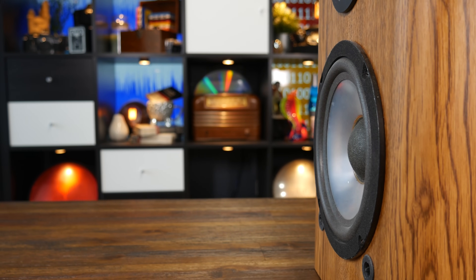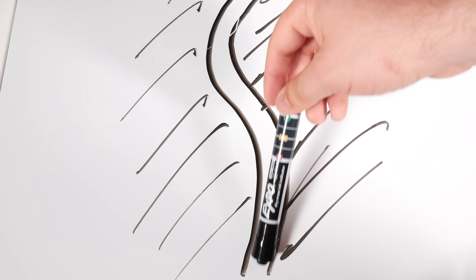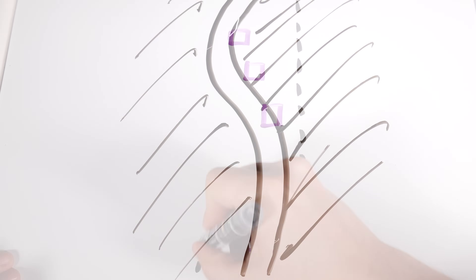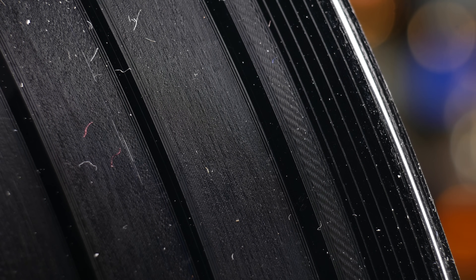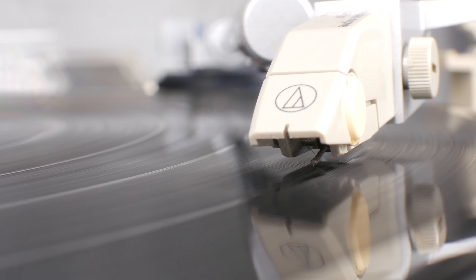Here's a crude analogy to explain the difference between analog and digital sound. A vinyl record's walls generate an analog signal by moving the stylus left and right. A record directly creates the analog signal via the motion of the stylus, but a digital sound source is instead sort of like a virtual stylus riding in a virtual groove. The sound samples are snapshots in time of where the stylus was. A DAC then creates an analog signal by running a virtual stylus through this virtual groove, placing it at exactly the correct location and generating the appropriate voltage level as defined by the samples.